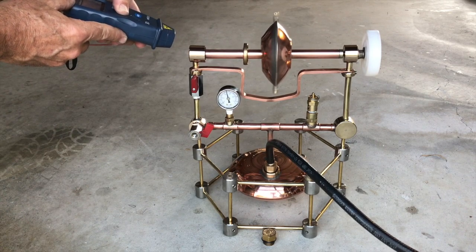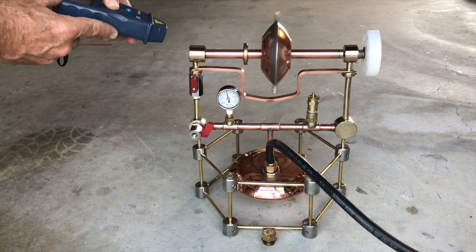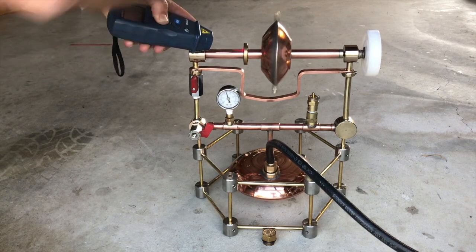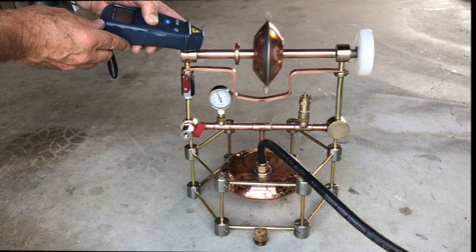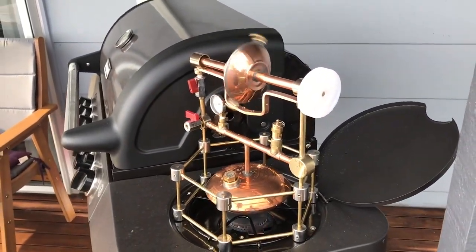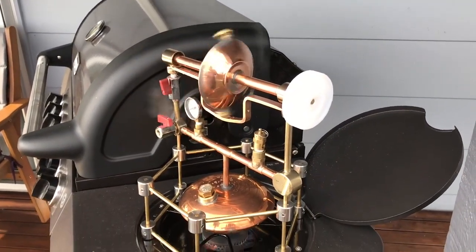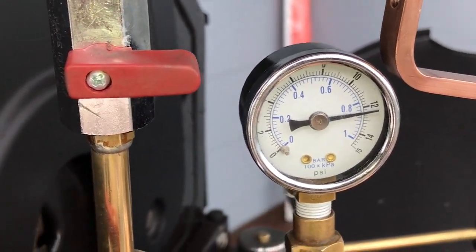So I had to start again and redesign it using little pivots on the end — small tapered pin shapes that fit into a similar inverse section on the end of the shaft, a bit like the internal parts of a watch. The white knob on the right is used to adjust the amount of pressure on those pins. Finally I have a version that works quite nicely on steam, and I will use that gearbox, though I'm going to modify the plan and gear it down as the next stage.